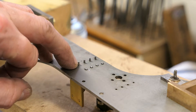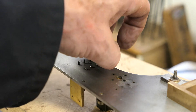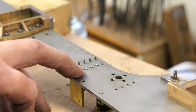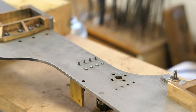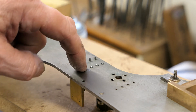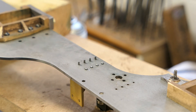The key is getting these to the correct length. It's fairly easy to work out how long the correct length is — these should be half of a sphere. The size of a sphere is four thirds pi r cubed. And the volume of a cylinder — you just get the volume of the cylinder to be the same as the volume that you want on the head, and that gives you the height. I'll write that formula out at the end of the video.